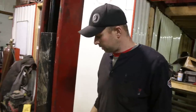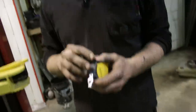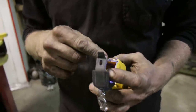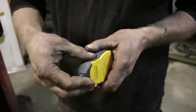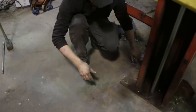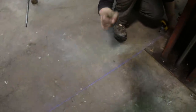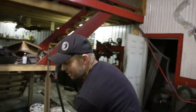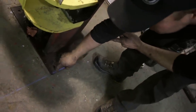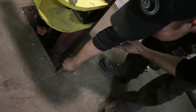Now, don't laugh — I've had friends come over from Europe who've never seen this invention before, which is just string on a roll with chalk inside. When you pull it out — that's called a chalk line — you hook it on, make a nice line, pull it nice and tight, snap it, and it leaves a perfect little line. That post is square. This one's on a slight angle — I'll drill one hole at the back and put a leg in there, then twist this post just slightly so it lines up with the chalk line.